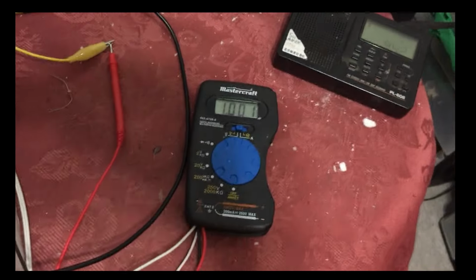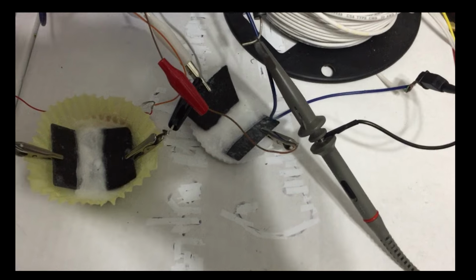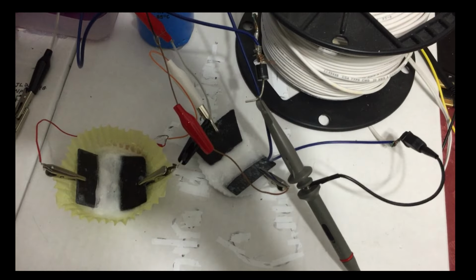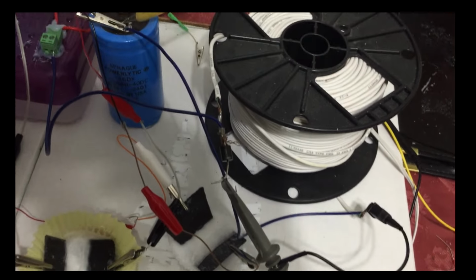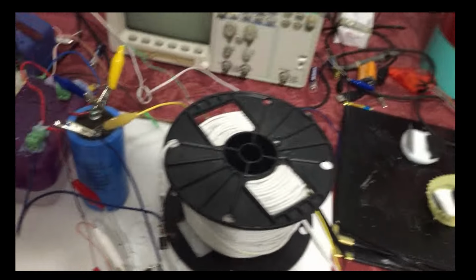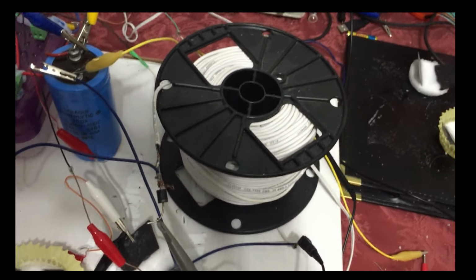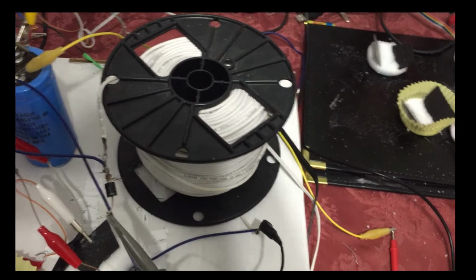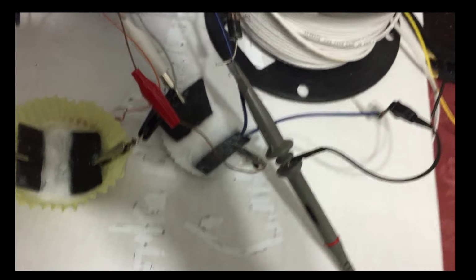Alright, so we're back up to over 1 volt now. So as you remember, as I initially turned it on, the short initially causes a drain, but it is coming back on its own. So you understand, if it was just the capacitor, once it shorts out, it wouldn't be continuously going up like this in voltage while it's being pulsed, which means shorted out continuously over and over again, a dead short, but still going up. This is what's going on.